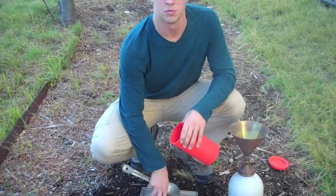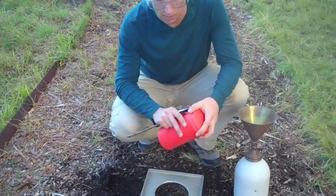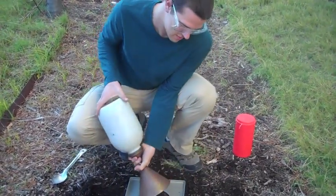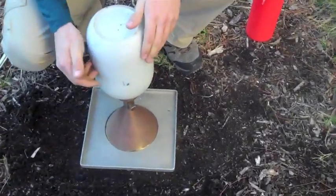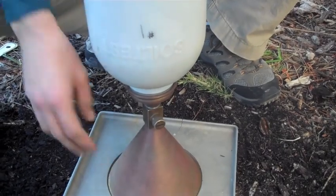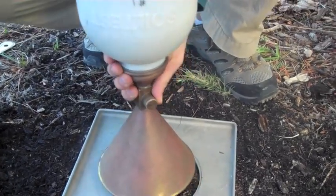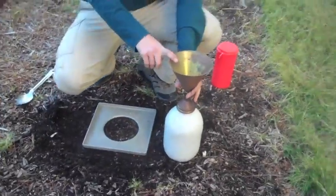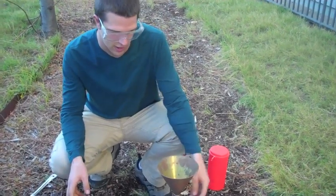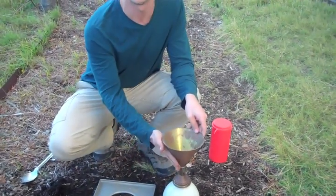Make sure that all of the soil removed from the hole is put into the canister, and after all the soil is removed, the top cap is placed on immediately so that no moisture is lost. After this is done, the sand cone is inverted once again over the hole and the valve is opened. The sand is allowed to go down into the hole as well as filling the sand cone. After this is done, the valve is closed and the apparatus removed. The mass is recorded again, and we can find the mass difference between the initial and the final to calculate the volume of just the hole by subtracting out the volume of the sand cone itself determined previously.